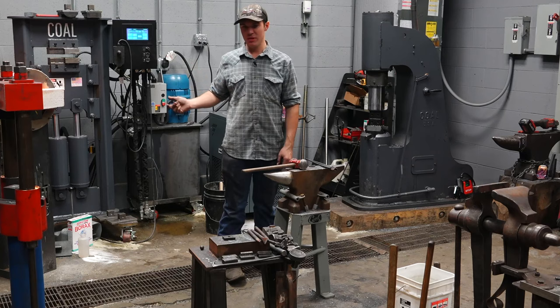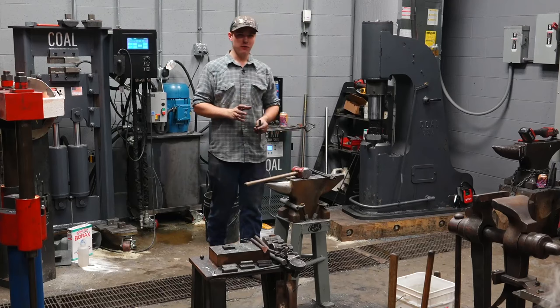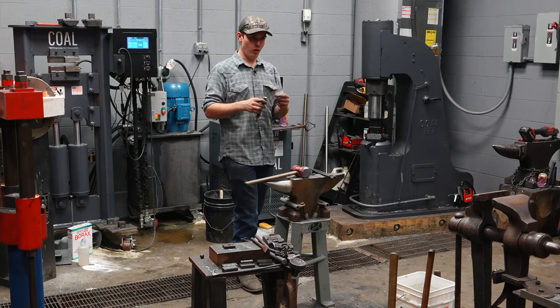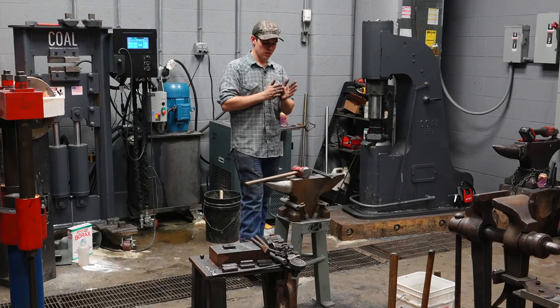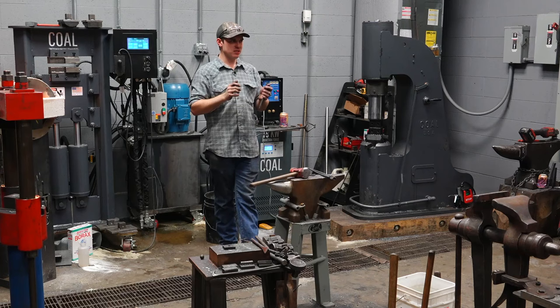If you roll material round while you're forging it, so if I'm a piece of round material and I'm forging it like this, if I'm actually forging it, moving material, and not just planishing, smoothing the surface, I will tear up the center of that material. I'll forge a literal hollow in the center of that material. It's called stove piping. The reason that happens is the material is constantly on the next facet binding against itself, and it's binding in the center, and it tears apart. Does that make sense? Has everybody seen that before happen to you? Okay, yeah.